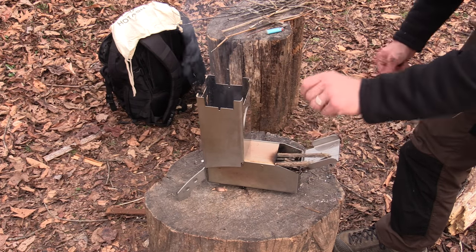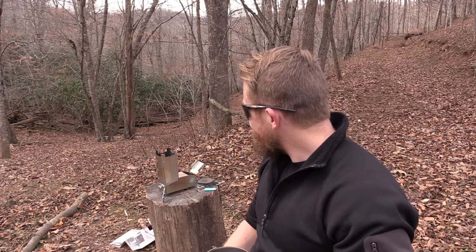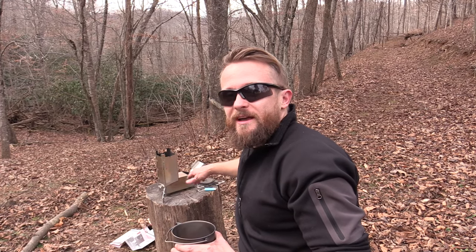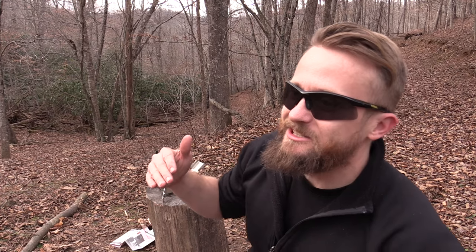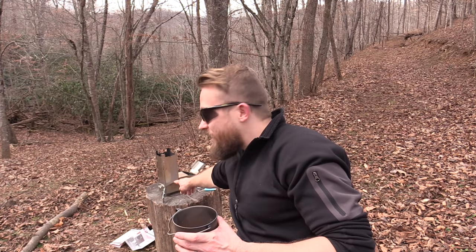When it comes to wood stoves, there is an element of fun when it comes to feeding the beast — that is what I call it. You take the wood, you put it in, and it continues to burn. I love doing it, my son loves doing it. But with this stove you feed in from this ramp and have to push it down through the tunnel — it is not much fun. Because of this design, it can take you a long time to get your fire going. With many other wood stoves, you simply take your lighter, light from the bottom, heat rises, dries everything out, gets it going. With this one, your ignition has to go down the body and then up the chimney — an additional step that decreases performance. It would perform better if it was just simply up the chute — imagine how much lighter it would be without the body at all.